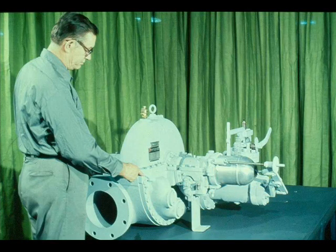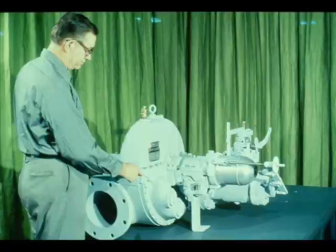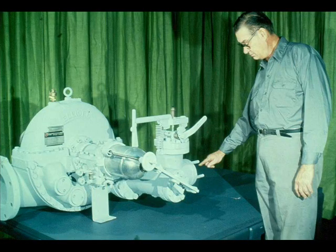Let's begin with the case. The rotating assembly of the turbine is enclosed in the case, which is split horizontally. The top and bottom halves of the case are bolted together with a sealing compound between them to prevent leaks. This is the steam inlet where steam is admitted to the turbine. There is a screen in this inlet to prevent the entry of any foreign material that could damage the rotor.